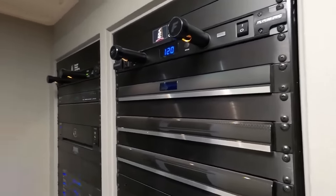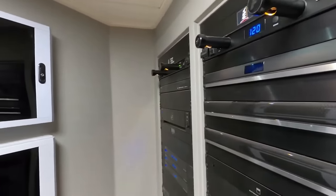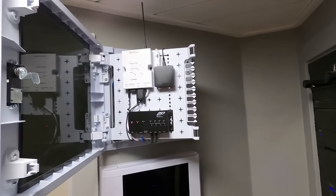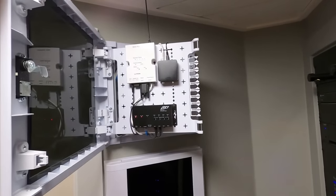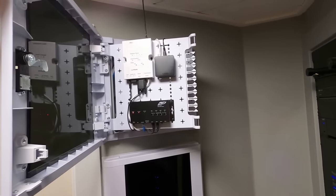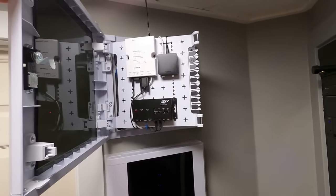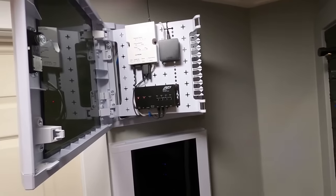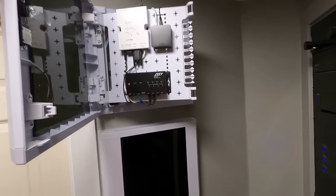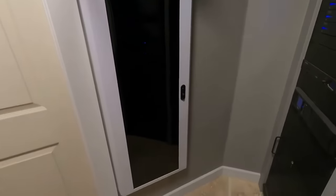And then that is being controlled two different ways. So we have this thing being controlled, pop this open, by the Lutron. We can go telnet and go back the opposite way and tell the Lutron to control a few things in the advanced controller. And then what we're also doing is using serial commands from the advanced controller to tell the RTI to do certain things on the main repeater of the Lutron, as well as doing only serial control to our advanced controllers, which are in the box below.